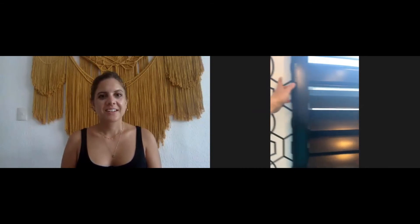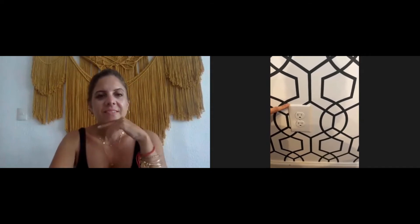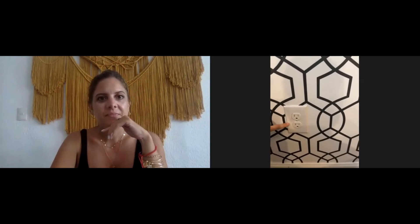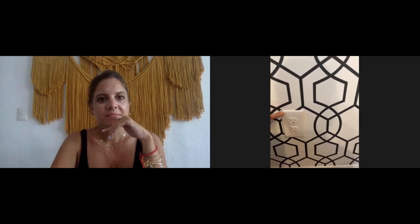And you're also going to have waste around windows. How are they so perfect? You're showing with the electric outlet and the window. So do you bring it down and then cut it neatly around? Like how is it cut so neatly? Just like when you paint, you want to remove the outlet covers, and then you score around the outlet cutout and put the outlet cover back on. So you'll never see the part that's trimmed around the outlet.